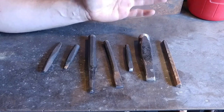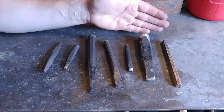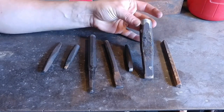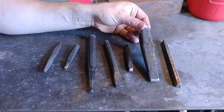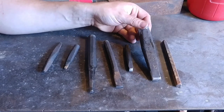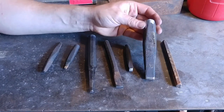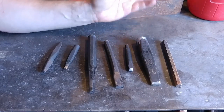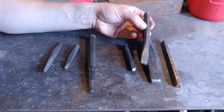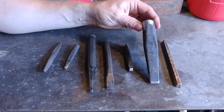Now we're going to get into the design of tooling. Whether it be short or long, tooling is only as good as its design and its function. So this here is a drift — for a hammer eye, and more importantly for sledgehammer eyes — and it's just made out of mild steel. As you can see it's got quite a heavy cross-section, and it's meant to be that way to take the rigors of beating it through a sledgehammer. If you did it with a small piece of tooling it would be awful weak and would overheat before it even got through the piece. So you need the added mass here.